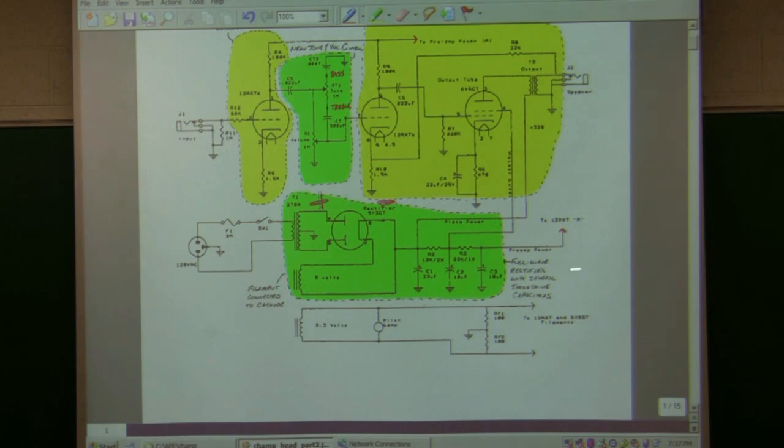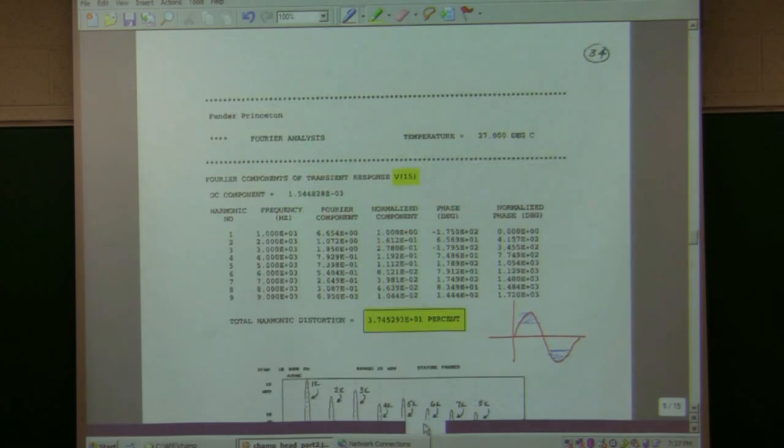And so that's going to cause these amplifiers to have different voltages when running them. And the gain of the amplifier changes with the power supply. So I changed the power supply by 10%, and the gain changed by 7%. So it's almost like a 1-to-1 ratio. But I didn't do the case from going from 220 to 150 volts at this node. But it took several seconds for it to respond, because you have these large capacitors here, and you get what's called an RC time constant. That may be what you're hearing. I don't know, I need to do more testing on it.